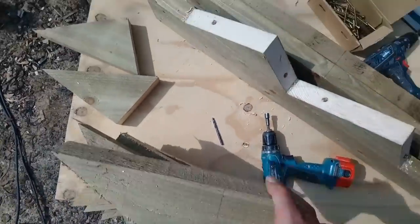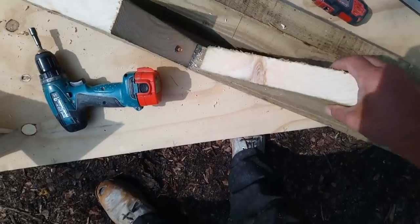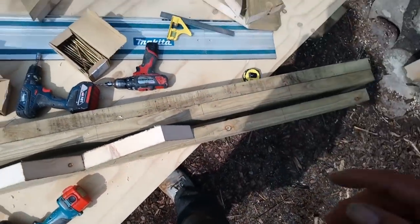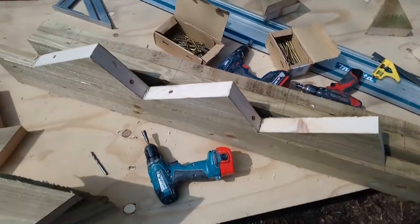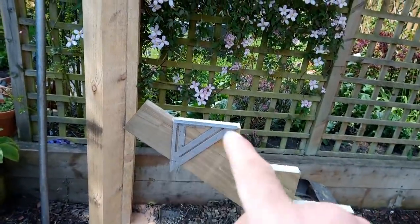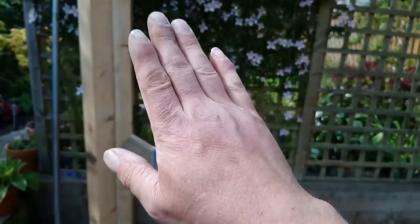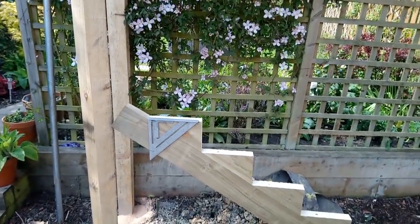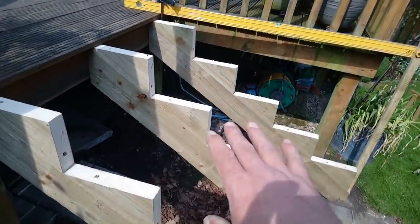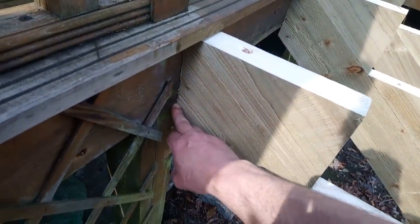These timbers — because of the way I cut them I've got the treated side on there, so I'll be going down, treated underneath. Just up to me to get plenty of treatment on these now. Tighten that up, move my way down, making a dinosaur. That top should just be 90 degrees from that top tread. I'm going to scribe the bottoms because it's a funny shape — I'll stand them up and scribe them down to the floor. Something like that — I'll make sure they're level and whatever they need to come down, I'll mark it.